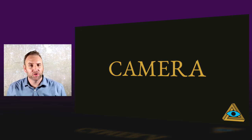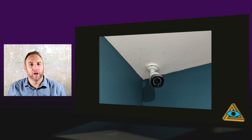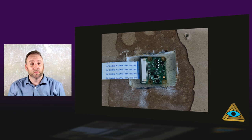You need cameras in an escape room — not just one, multiple. You need multiple angles to see what players are working on and how to help them. The first cameras we bought — I hate them; I call them immersion killers. They're big, bulky, and everyone notices them. Our solution was the Raspberry Pi camera: it's the size of a quarter and fits pretty much anywhere. You can put it behind veneer, wood, or drywall. The quality is 5 megapixels, though you can get an 8-megapixel camera. Just scrape out the back of whatever you're using, put a pinhole in, and it's working.